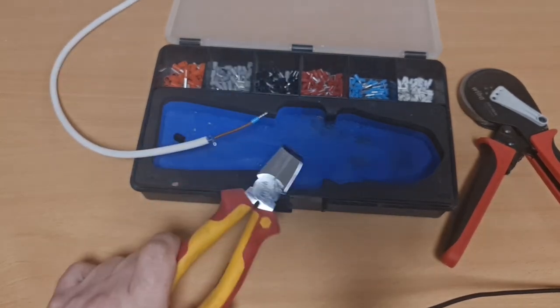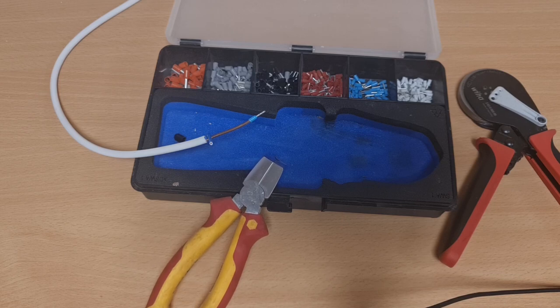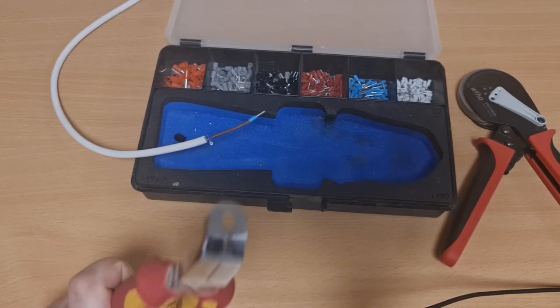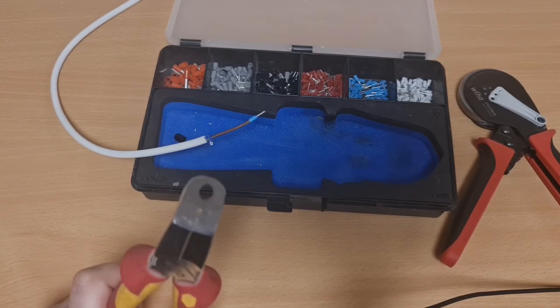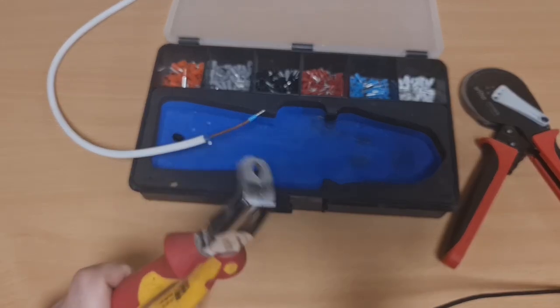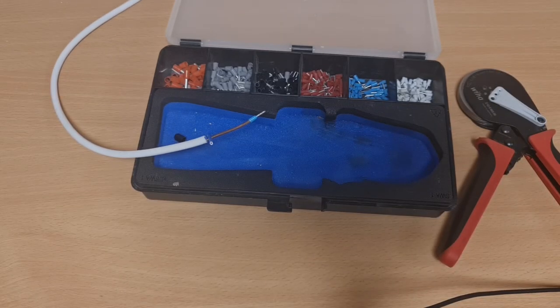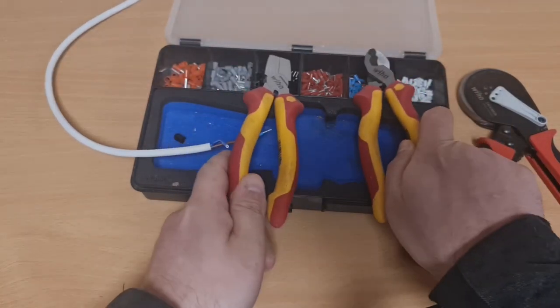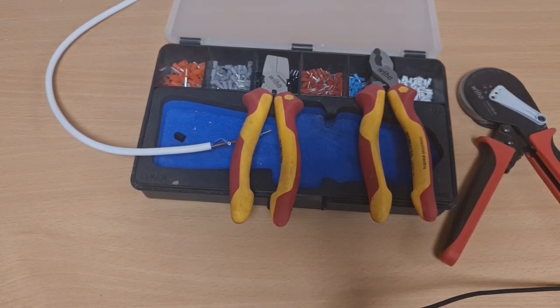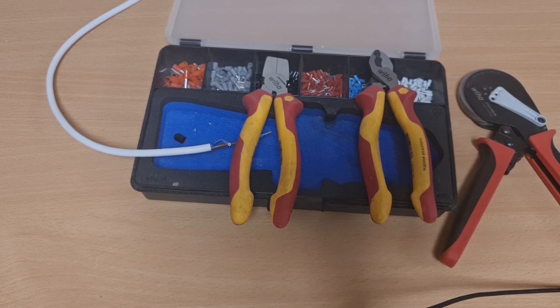There are particular products for certain tasks - you must use the right ones. While we're talking about flex, there's this Weidmüller tool - it strips the outer sheathing through that end point, and it also has a 2.5mm and 1.5mm hole. If you've got normal flexible cable or even heat resistant flex, this works really well. If you're doing a wiring centre for an S plan system with a few flex cables, this is brilliant - you don't need to mess about with a knife. It'll take the outer insulation off without marking the inner insulation if you're careful. These 160mm croppers with a serrated blade fit in my hands very well.